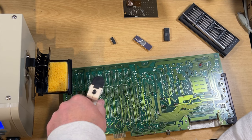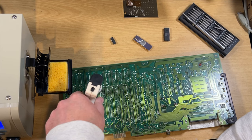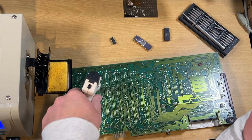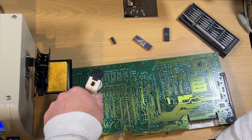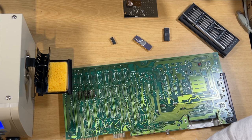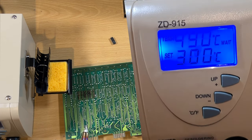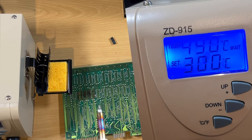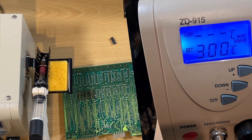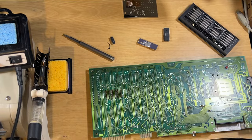I don't know if you noticed that - the tip of that hole doesn't look right. Just desoldering away... now you can see the shaft of that thing, how red and glowy it looks. That's not normal. The temperature is set to 300 but it's reading 490, and it just kept going into an error. You can see how bad it is.